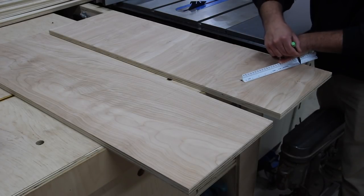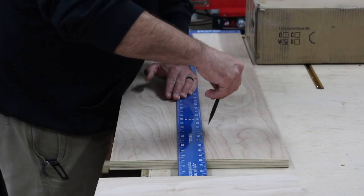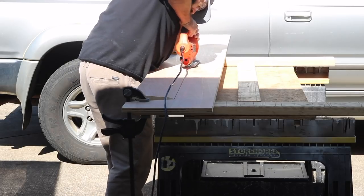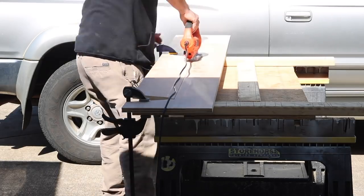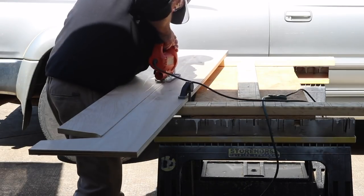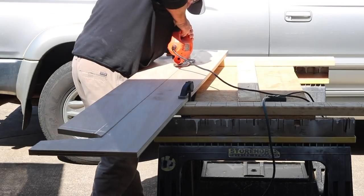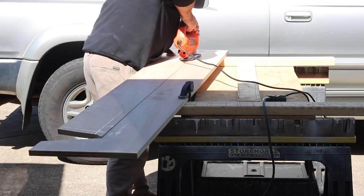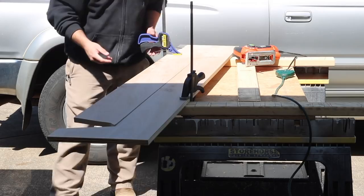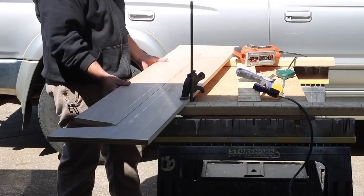The first thing that I do is just break down all the plywood, and then I'm going to add some design elements into this bed — making all of this out of plywood. I'm going to be adding in some angled legs and cut out all of these sides and ends with a jigsaw to give me my leg profile. One thing I learned through this whole process was that I needed to just trust the jigsaw and let it do the work — I tried to rush a couple of cuts and my blade started wandering on me.